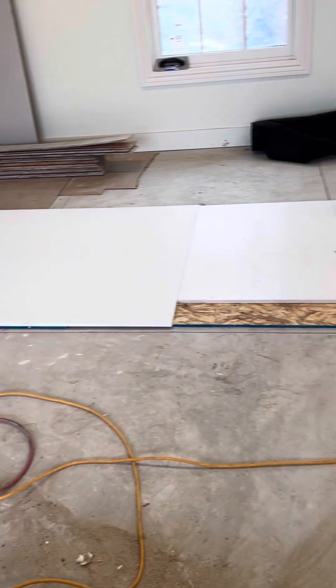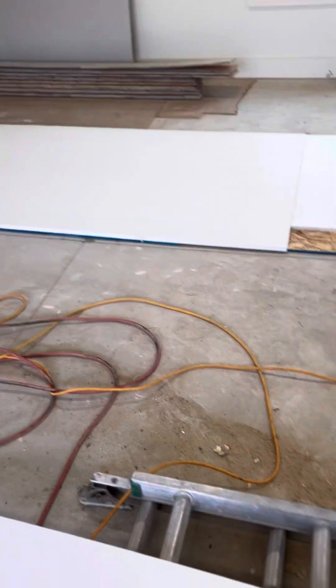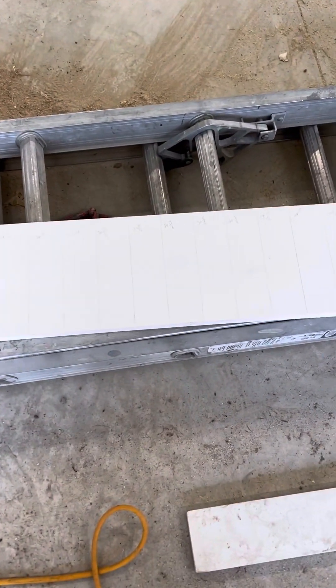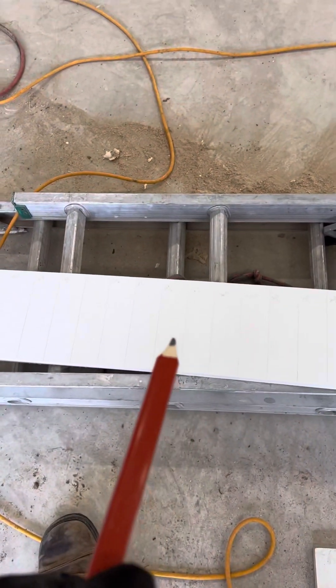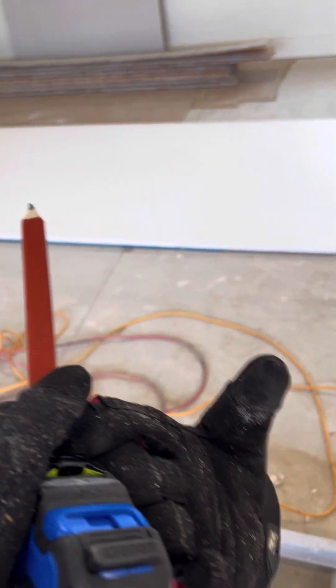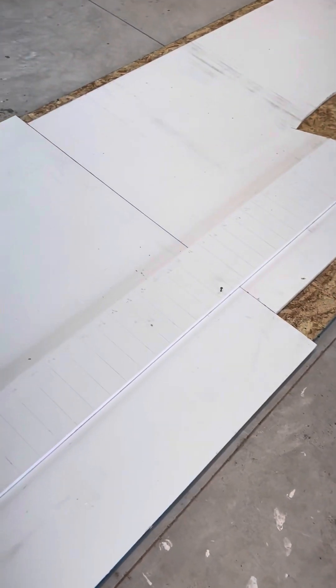Here I have my sheets of Azek laid out. I've got a scrap piece I can use — unfortunately this thing is longer than my material so I have to put a seam in there. My largest number was 30 and 7/16ths, so I'm going to set this board parallel to the top of this sheet at a little bit greater than 30 and 7/16ths — just went 31 inches.